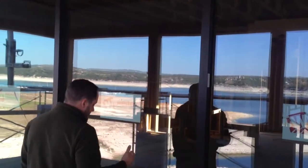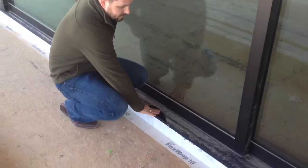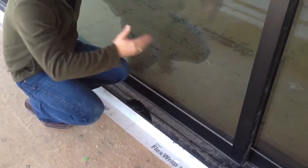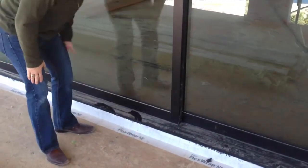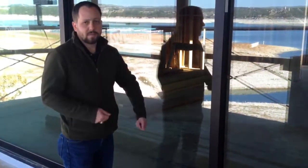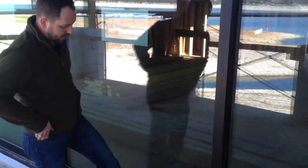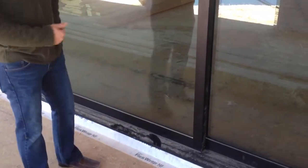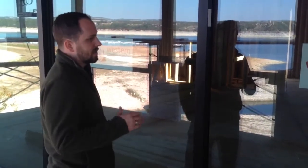One of the last steps, and this just helps out tremendously, is this product uses a sill cap on top of these sills. Part of the big problems, particularly with gliding patio doors, is they tend to just get obliterated during construction. Drywall, dust, you can already see a lot of sawdust built up on this right now. And it's a bit of a hassle vacuuming it out at the end of the project. Utilizing sill covers like this allow you to put the door in, snap the sill covers down, the door stays closed, protected, and it protects everything from getting inside that sill, so at the end of the project you just pull those sill covers up. It's ready to go. You don't have to deal with all the drywall mud and everything else that gets down in there. Just helps, again, the operation of the door, helps keeps it nice and clean.